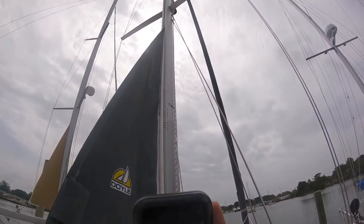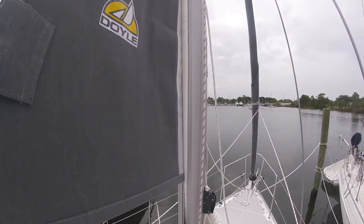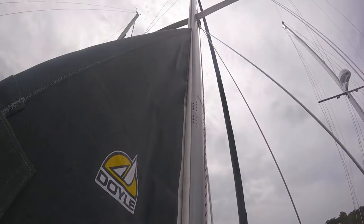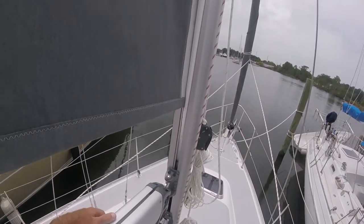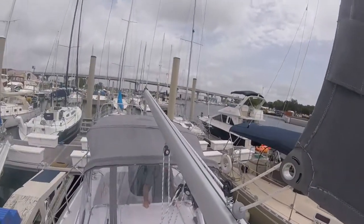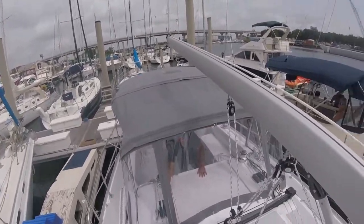Good morning, good evening, good afternoon everybody. This is going to be pretty basic for starters. We've got a jammed mainsail inside of a Selden roller furling mast. It's a very nice brand new Doyle sail with vertical battens. What's happened is basically a slight user error with the roller furling drum mechanism — the continuous line roller furling drum mechanism at the bottom. The sail was attempted to be rolled out without using the outhaul, simply by using the continuous line furling mechanism, which has caused the sail to bind up inside of the mast.